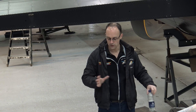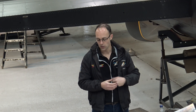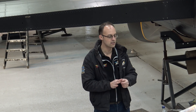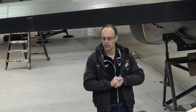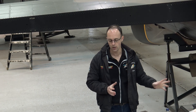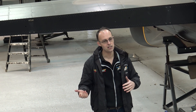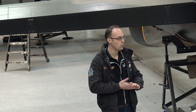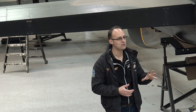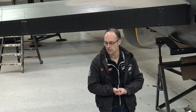What we found with the structure inside the wingtips is that none of it was painted — just bare aluminium, no protection — which meant we've had quite a lot of corrosion on the skins and all of the forms within the wingtips. So they've been completely broken down again like this section was: all the rivets taken out, reduced to component parts, everything assessed, and new pieces made where required. The wingtips are about 75% new material because of the amount of corrosion we found inside them.